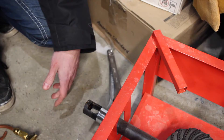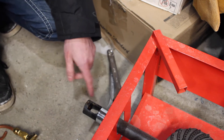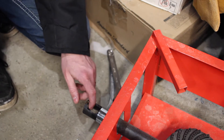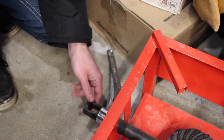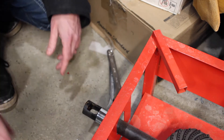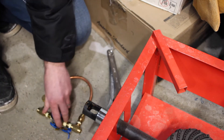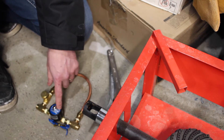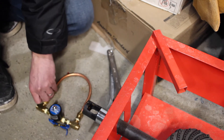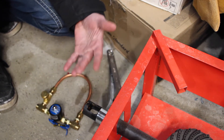It's cold out here. This is a propane burner that I'll be using to melt lead, but I want to temperature control it. I saw an SV Seeker video where he added a temperature control to a propane burner using a really crafty technique — using a solenoid valve and a bypass. The bypass sets your pilot flame burning level and the solenoid valve sets your full flame level.